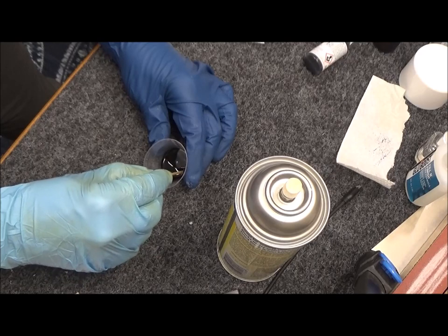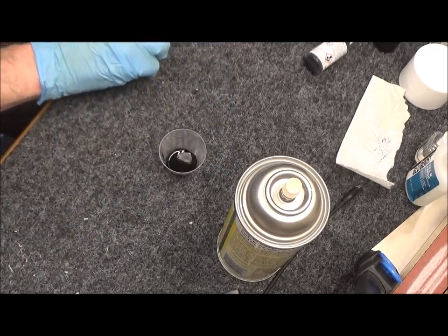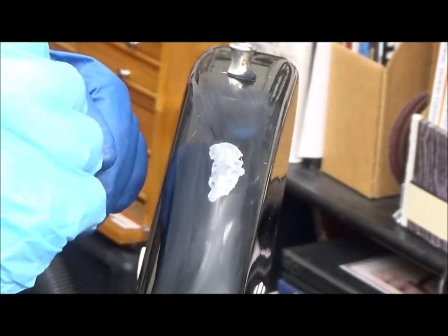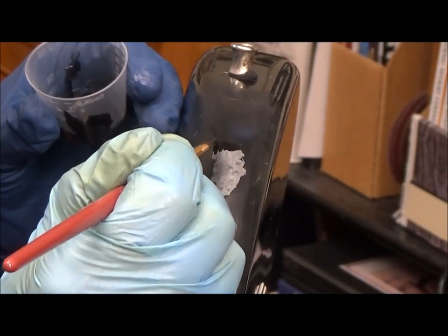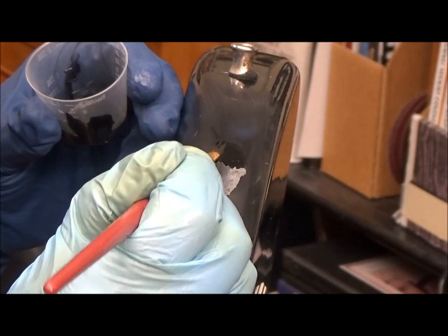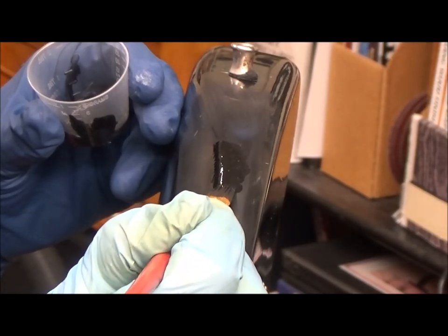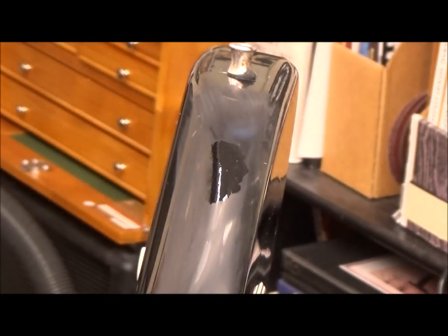I want to mention that after I do the color coat, I did another nine coats of the fill and finish thin before I wet sand. I lost some of the footage on the wet sanding and polishing. Right here I'm dropping in the black with a brush and I did two kind of thick coats. If I were to do it over again, I would have mixed more shellac into the cup and brushed on like four or five coats with about 15-20 minutes in between each coat, because these two thick coats took 20 hours to dry. I had to wait until the next day to do the nine coats of fill and finish thin over top.